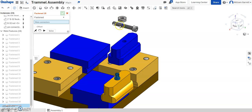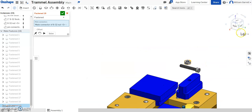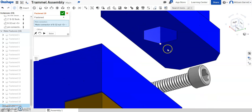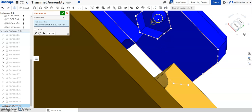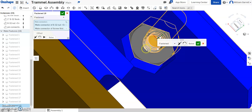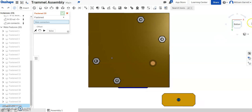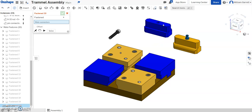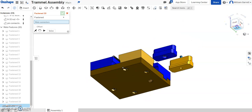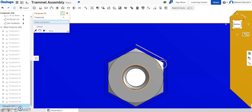Next, we'll do our screws. I'll place the nut on the bottom first to locate it — it's just a fasten mate. I get the center of the screw by moving from the outer edge to the center, then locate it on the bottom of the screw slider block. I hold my mouse to rotate and get to the center of the hole at the base. It appeared upside down initially, but after flipping it's in the correct spot. Moving to the side for a better view, the screw appears to be lined up correctly, so I don't need to spin it as on previous parts.